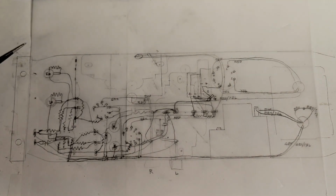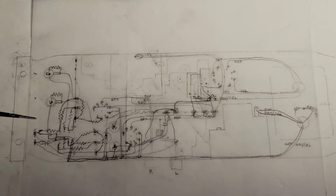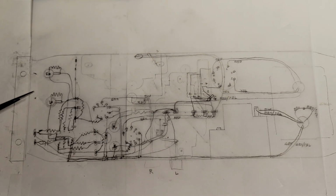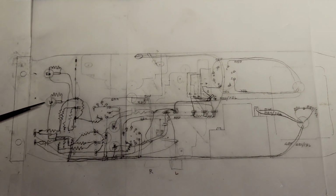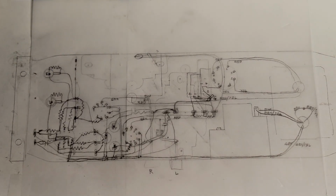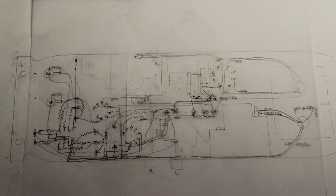It's better to have them farther apart because modern RCA jacks are bigger. Typically, we like the aesthetic of them being aligned with one another. Of course, that's not necessary. And I decided in this case that utilizing the original holes was preferable to drilling a new hole, or patching the old hole and drilling a new hole, whatever, simply to get these aligned with one another.